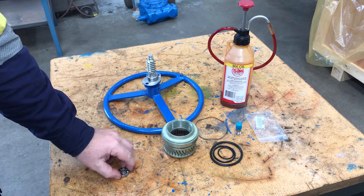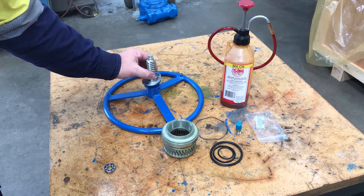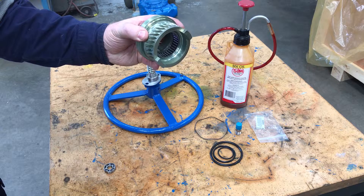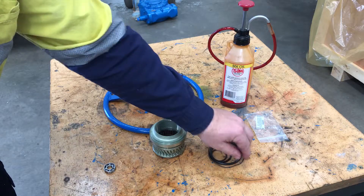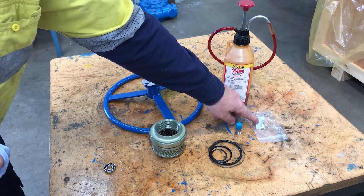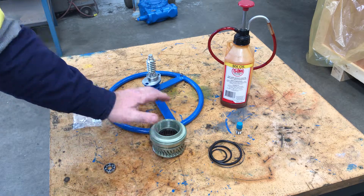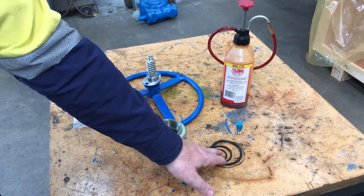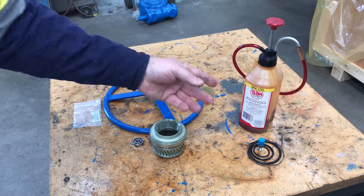The parts we're receiving are the rear bearing support, the pre-assembled hand wheel, shaft adapter with the seal already in place, a side mount hand wheel adapter, one spare set of O-rings, seals and wave washer, extra oil and some open stickers, directional stickers. We'll be sending a full set of these for each actuator, and just the one set of oil and spare O-rings.